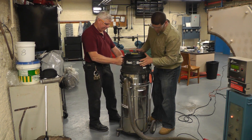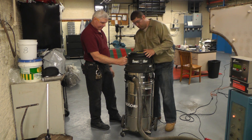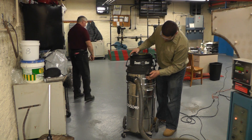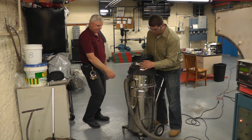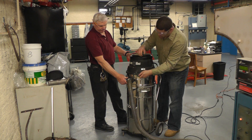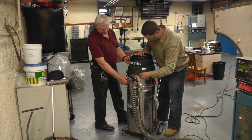It sits right on top of that 20-gallon stainless steel drum. It's got a tangential intake on it so that the soot doesn't clump onto the filter when it comes into the vacuum — it actually cyclones down into the drum. You have a disposable bag there for collecting the soot and throwing it out afterwards.